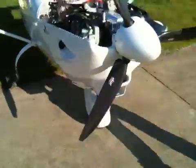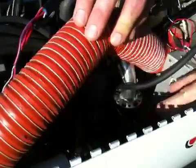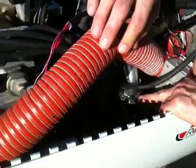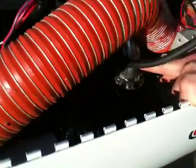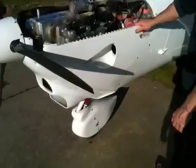Come around to the other side to see the pump. Moving the scat tube out of the way, you can see a 12-volt Davies Craig electric water pump that draws about 2.5 to 2.8 amps maximum, so it puts no stress on the charging system. The pump is directly mounted to a right-angle bend on the common pressurized cold-water rail. It's not mounted to the airframe — the rail itself is mounted using two P-type clamps and a welded tab on the diagonal brace of the standard Jabiru engine mount.